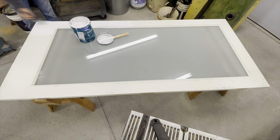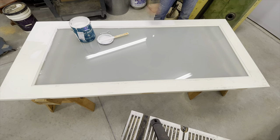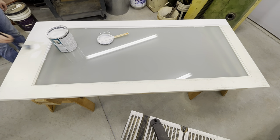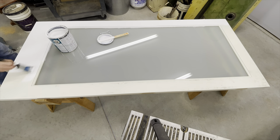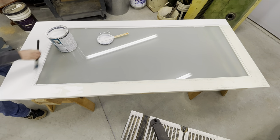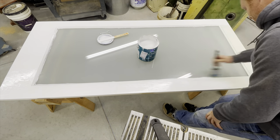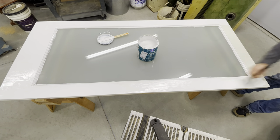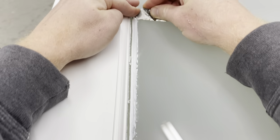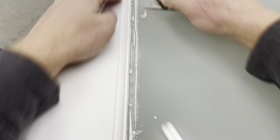The color I used to paint this door is called High Reflective White by Sherwin-Williams — the same color as the walls in the room already. I ended up applying three coats of paint: two before the install and one after as a touch-up coat. I didn't tape off the glass because I knew the paint would come off fairly easily when dried, and it's frosted glass so if I scratched it a little it really wouldn't show. I just used a razor blade to remove 90% of the paint I got on the glass and a wet towel to remove the rest after the touch-up coat.